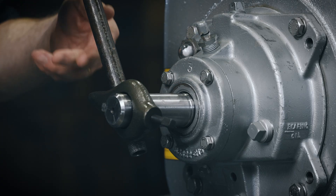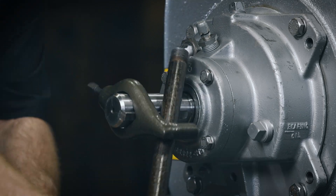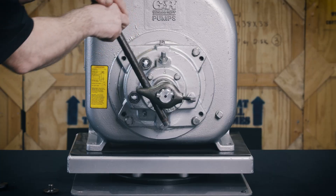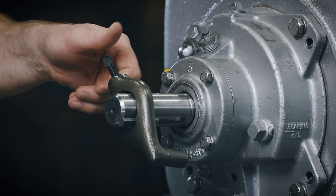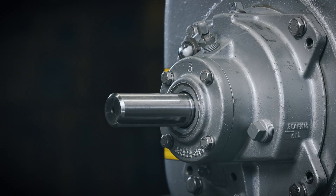While the impeller rotation is still blocked, use a long piece of heavy bar stock to pry against the lathe dog in a counterclockwise motion to break the impeller loose. Be careful not to damage the shaft or keyway.